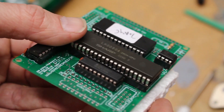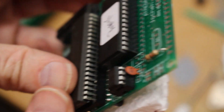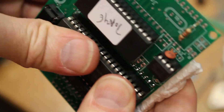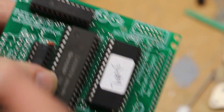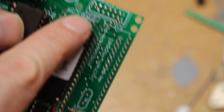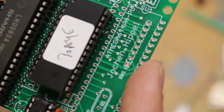Sometimes it is tricky making sure all your pins are lined up, because if they're not and you push it in, you could bend a leg. Look and make sure everything is going into place before giving it that final push. Now that it's in, I like to double-check my work and make sure that circle there matches up with where it says pin one should be. I also like to make sure all the other chips are plugged in the correct direction — there's the little notch, which is indicated by that dot. Sometimes there's an actual notch on the chip itself.